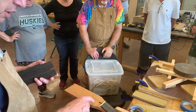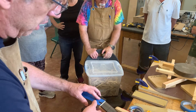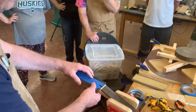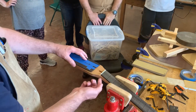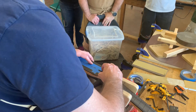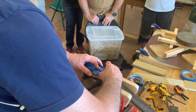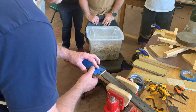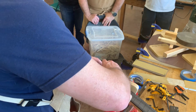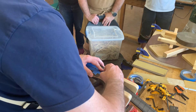Here's one side of that scarf joint and here's the other. When you put this across it, it gives you more gluing area and increases the shear strength — this makes it a lot stronger. There's nothing we can really do to break that joint; if it breaks, the rest of the guitar is probably a write-off. It also locates your string, which may be the most important thing it's doing.